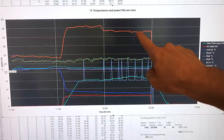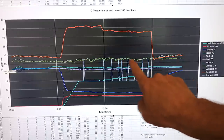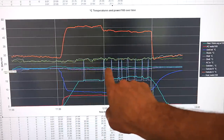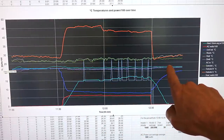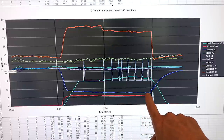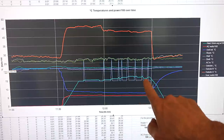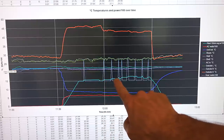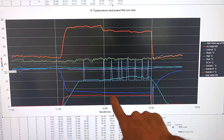The orange line is temperature coming out the back of the AC, getting over 45 degrees. The green line is temperature going into the AC, hovering around 26–27 degrees, fairly steady. This cluster of lines together are the inside temperature — quite steady over the course of the experiment. The blue line is temperature coming out of the AC, going down as low as about 7 degrees. The light blue line with spikes is the heater power; I averaged that over a 10-minute period and that's the cyan line. The red line is power consumption used by the AC.